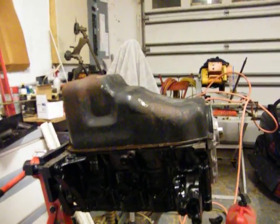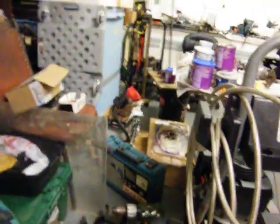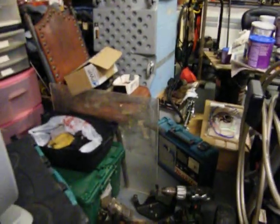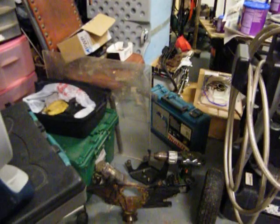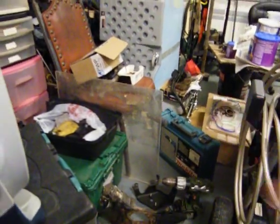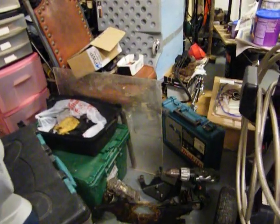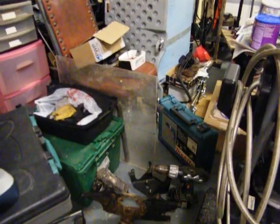I've got a lot of money and time tied up in this thing. That bracket over there came up real clean. Once I get it all together I do not want to take this back apart — getting that pan out would be a pain, like that bracket, another pain just changing bearings. But all that cleaned up really well. I need to take the starter apart, oil it, and clean the armature and brushes.